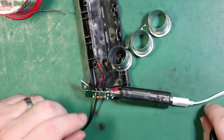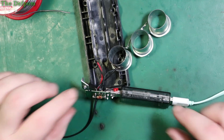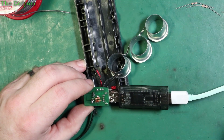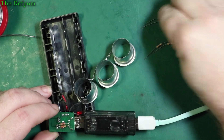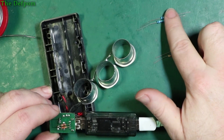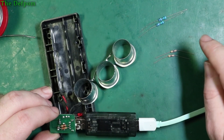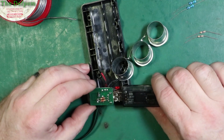So there's some confusion about the pull-ups and stuff, because I noticed the reference is a 3.6V pull-up voltage, which just doesn't make sense. So I've got alternatives I can try - this one is a bust. I'll take those back off again. Now the next one I'm going to try is the Apple charger method. Since this is an Apple phone, it's likely to be using Apple protocol anyway - though I'm guessing it might work with Samsung still. You can do a resistor network using 50K and 75K resistors to create a divider giving a signal for 500mA charging current. I think if you use 43K resistors instead, you get a 1A charging current.